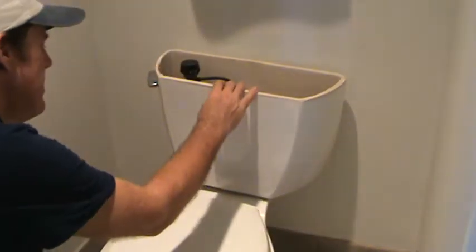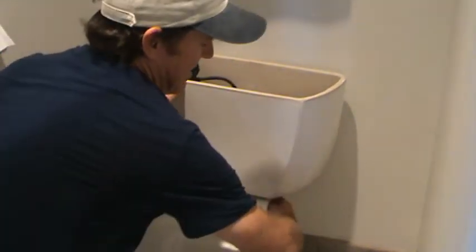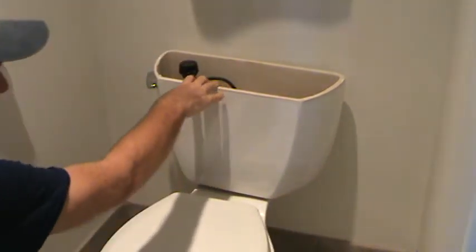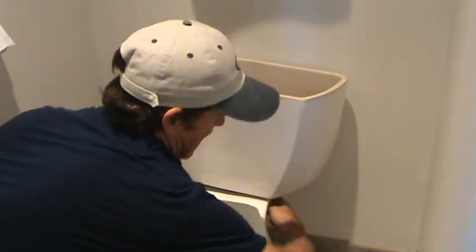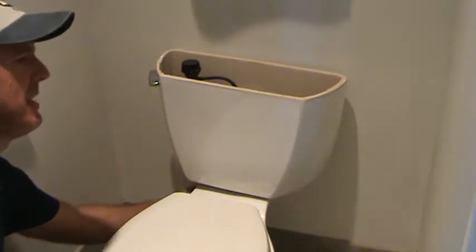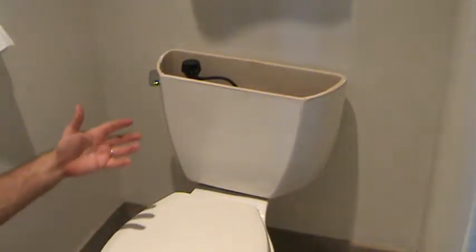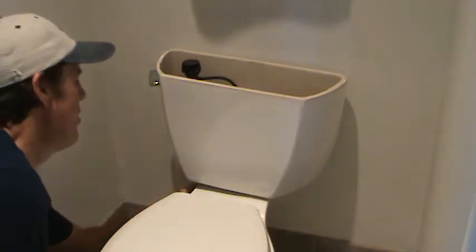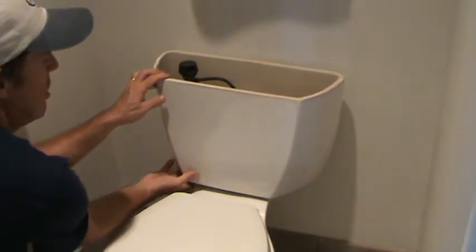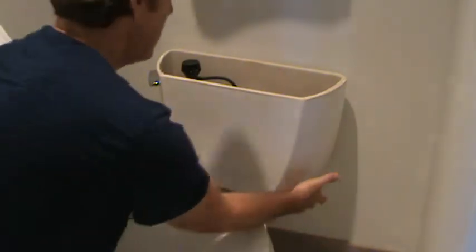You can tell that's crooked, but let's say you tighten that nut up all the way and you think, oh, I'll just go over here to the left and I'll tighten this one down as much as I tighten this one over here. And you keep going and going and going, and it's getting tight, but you think you got to go even further because you're for sure certain it's got to be the same. This is sticking out 5/8 of an inch below the end of the nut. You know, this side needs to be done the same or something like that. This is just an example now, okay? And you go and you try to tighten this one further or something, and you can't get it, and you tighten it down and it cracks. You could crack this tank because you started off with it crooked.